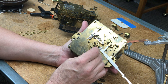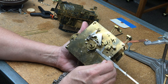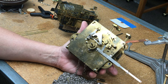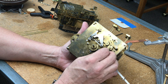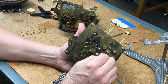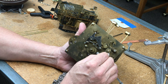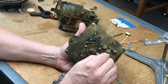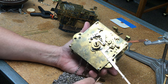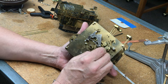Anyway, there will be a lot of these movements out there, and if you want to oil up your own movement and service it, give it a light cleaning — I will show you how to do that. The first thing we're going to do is dig out these pivot holes with a toothpick and get whatever bits of old oil and built-up gunk out. Oil dries, and if you use a really good oil it won't even start drying for 10 years. If you use a bad oil, you're good for a couple of years. See, that's just one pivot hole and I've already got that much dirt out of it.